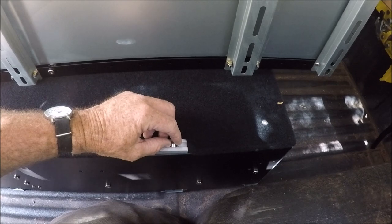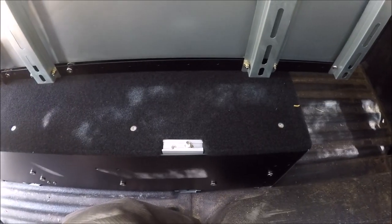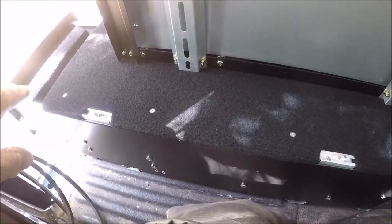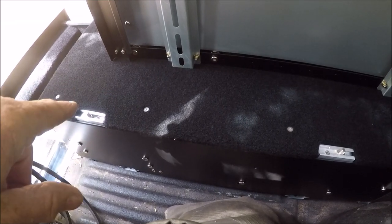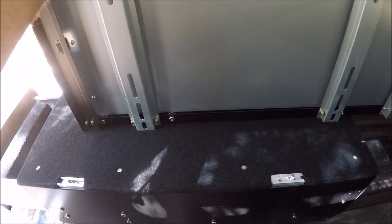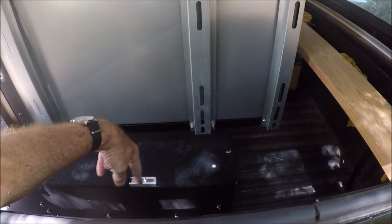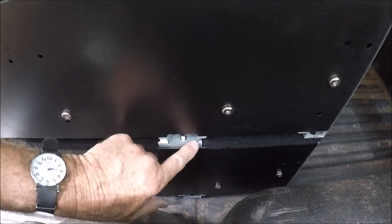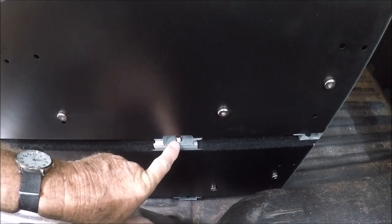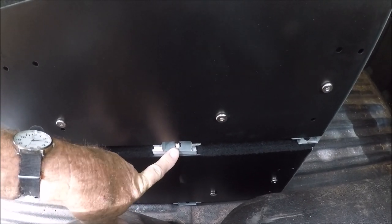I'll just carefully place each of those in there - they can't come out because that's like a T-slot - and I do this on each of the aluminium slide T-slot pieces on either side of the unit, then I'll very slowly bring this over to match up with the holes that are in the base. The bolt is now in the T-slot; all I have to do is put a nut on each of these four and a spring washer, and tighten it down.